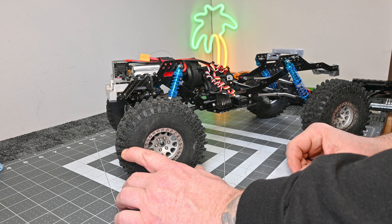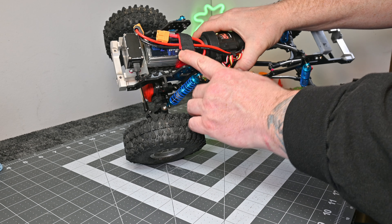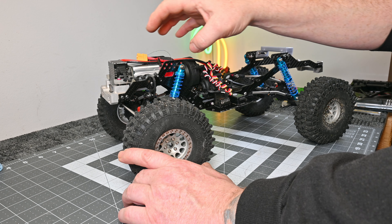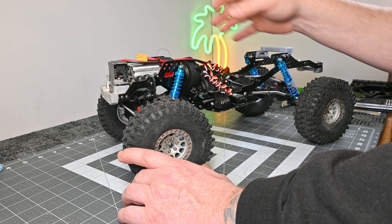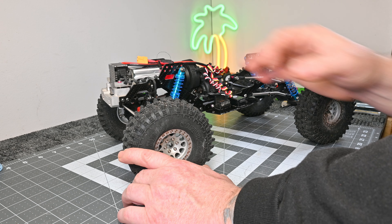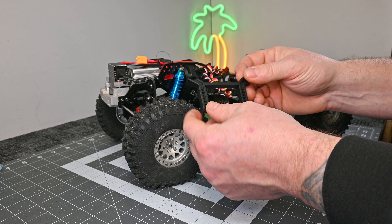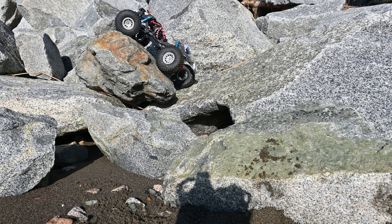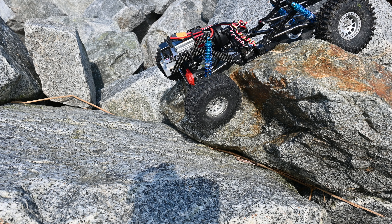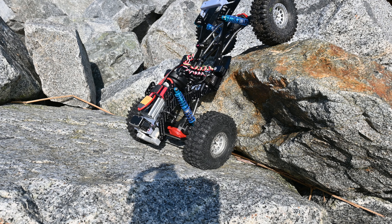I've designed a custom skid, and what I think is unique is mounting the 3S 1500 drone battery up front. I'm currently making some different plates in some different areas. I'll show you how the battery mounting is laid out — this is version one of the skid and version one of the battery plate. I'm also working on some body mounts to adapt the TRX4 body mount kit. Essentially I took an Injura carbon LCG kit, bought a Stealth X transmission, and in Fusion 360 drew up a plate for the transmission.